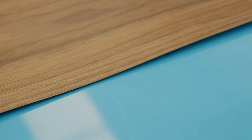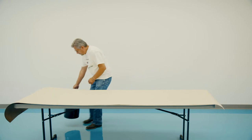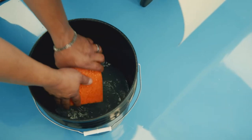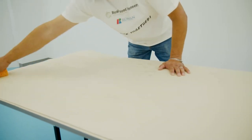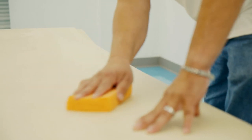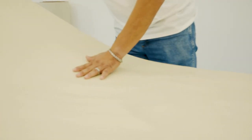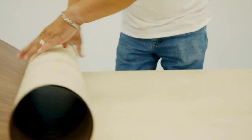Factory trimmed edges must not be butt jointed during installation. You'll want to overlap and double cut all your seams with a razor blade. Lightly dampen the back of three sheets of wall covering with a cellulose sponge. Once all the sheets have been lightly dampened, roll the sheets and let sit for 20 minutes while you prepare the wall for application.